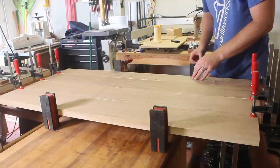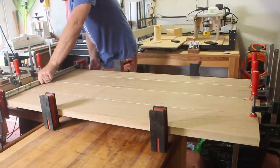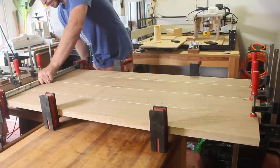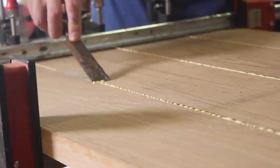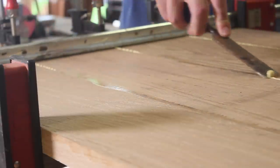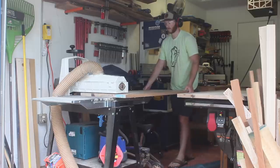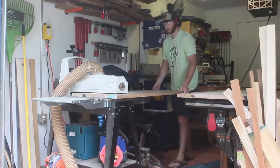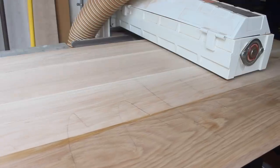The outer casework needs a 1-inch finished thickness, so I purchased a lot of 5/4 stock. The long divider is 3/4 inch thick, while the short divider you'll see later is 1/2 inch thick. I like using solid wood for my projects because it lets me easily alter material thicknesses, which I think can add a lot to a design. Playing with proportions is key. A huge table like this might look too light with 3/4 inch thick material all around.